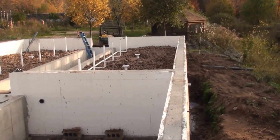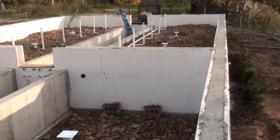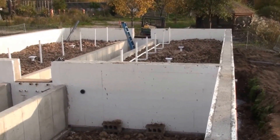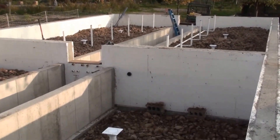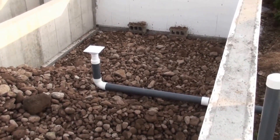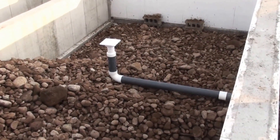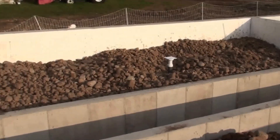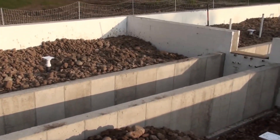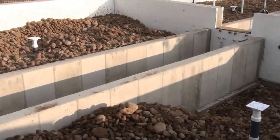I'm here at the greenhouse on the most northwest corner. It's almost 70 feet long and 32 feet wide. We're filling in the thermal mass units — they're about four and a half feet deep of washed stone for the thermal mass. I've got the floor drain here; that side's got a little bit more. I'm putting one more plumbing line through. This is the more tropical area, the warmer part of the greenhouse during the winter months.